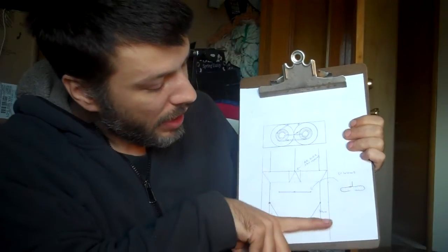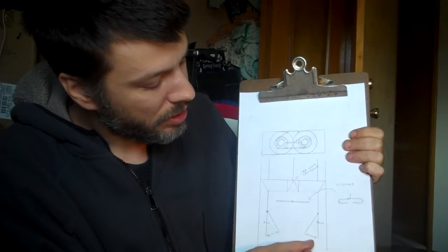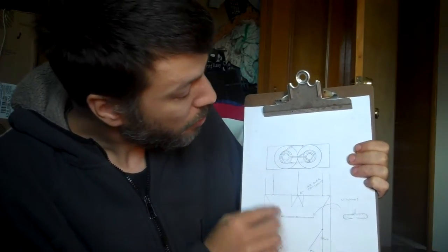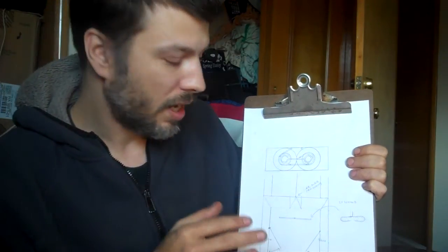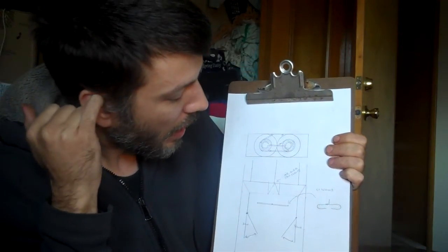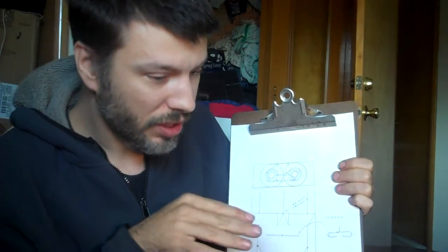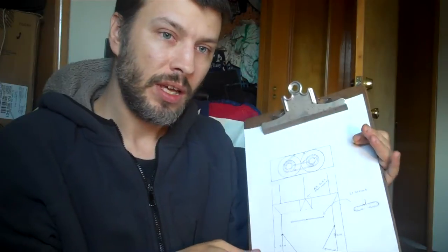On the back end of the system, I haven't determined a final cut line, but I'm thinking of doing these as a somewhat bent design with a hook on it to shrink the length of the engine system up a bit. It's going to have servo flaps on the galvanized steel that'll come over and actually help to vent this. I'm going to fold the metal so that the extra air coming in between the two engines — top and bottom — will be vented over the top of the afterburner can.